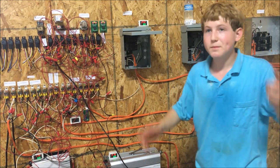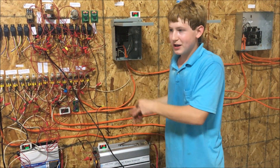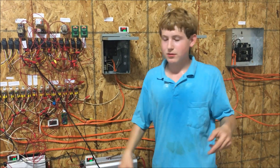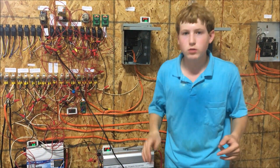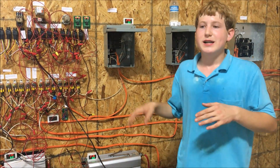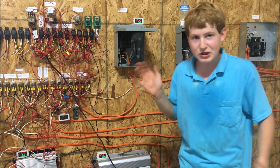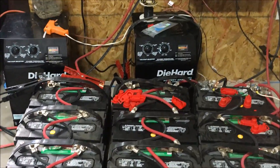In parallel wiring, if one panel fails, everybody else keeps going — and that's already proven itself. We've had the system running 30 minutes and it already manifested. I installed 18 panels producing 5.75 amps each. When I hooked them all up, I was only getting about 6 volts with no load on 12-volt, 21.6 open-circuit-voltage panels. I diagnosed it: one panel was putting out only 1.7 volts while everyone else was putting out 19 to 21.6. I pulled that panel and the remaining 17 are running fine.